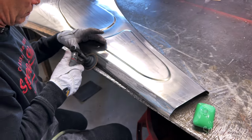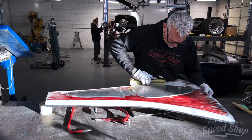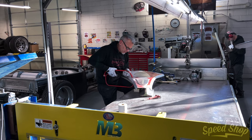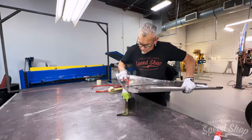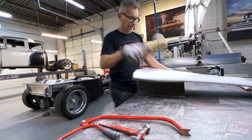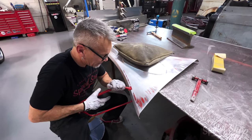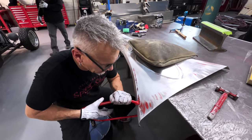It's going to be a little skinny hood. The owner didn't want a hood, but we had to do a radiator support from the cowl to the radiator. So this is going to be what we call a bikini hood — it's going to have a nice sexy curve to it. All the engine's going to be exposed as much as we can expose it, but still protect the carburetor, alternator, and all the goods from the elements. This car lives in Florida, so it's going to rain every day.